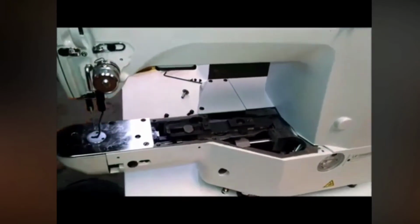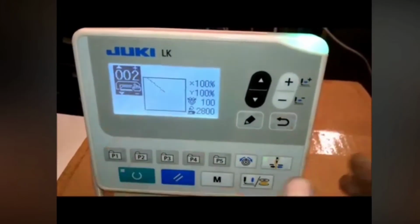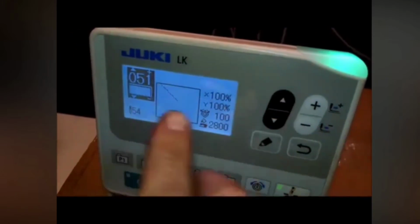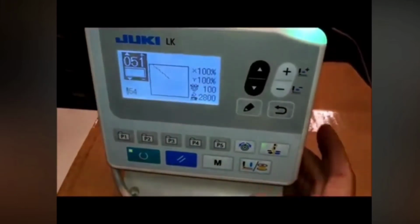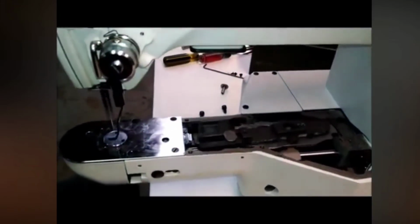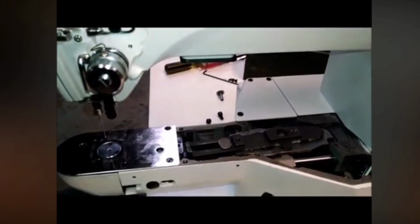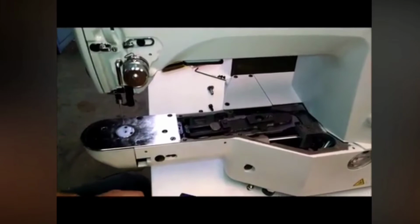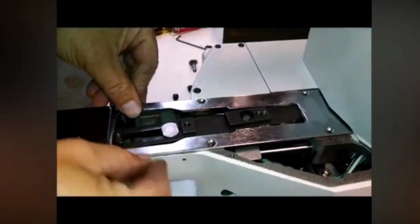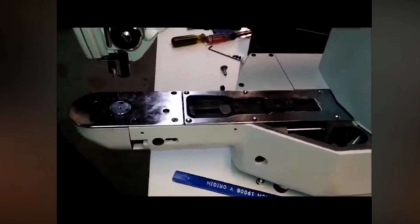And then we can exit out of here. We're going to go to our pattern, Pattern 51. And if everything is okay, the machine should cycle and not lock off again. And so it does. So then what you would do is reinstall your plate here. And we'll show you in the next video how to check the pattern.